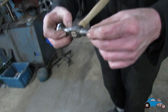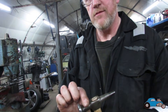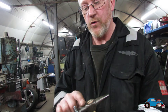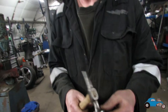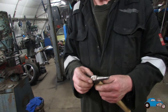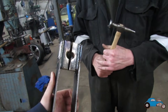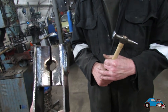So how are we going to do that? We're going to need a tool that has got a half moon in it with a hole - measure that - about 16mm roughly. We'll keep squeezing that all the way around until we form this, leaving the bulk of the material and pushing that to the end. Right, do you mean something like this by any chance? Exactly like that. Oh, that's handy - yeah, well done, did you just make that? Yeah, as you were telling me, I just thought of it!